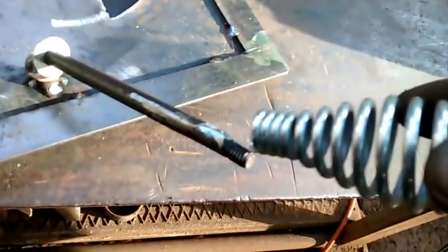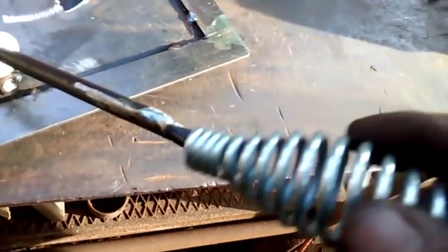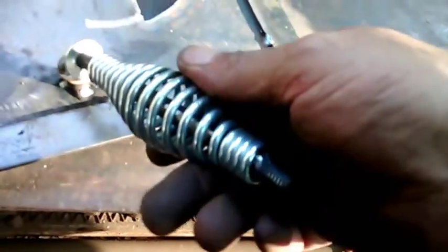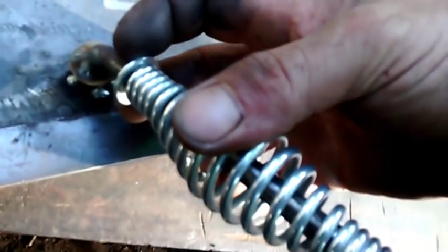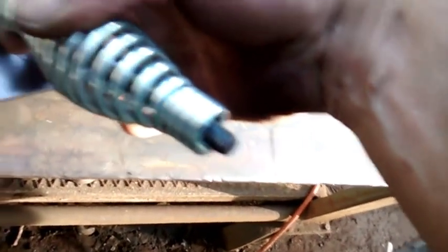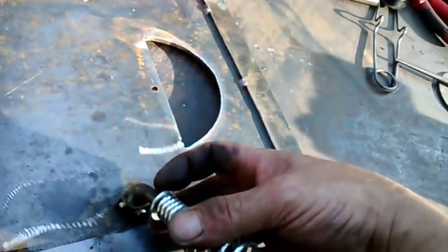So the next step is to put another washer on there. If you welded that bolt in, you're going to have to buff your welds back down so that washer and the spring will go over it. Then slide your spring on, stop it about where your nut's going to stop, slide that washer up to it and tack that washer to it — that way your nut will go on the bottom, another washer and the nut. So I'm going to tack that on and go ahead and hinge this thing to the firebox so I can show you the last step on it.